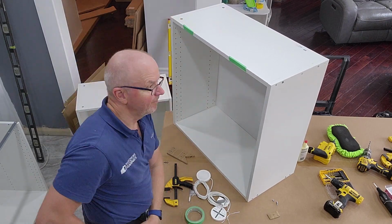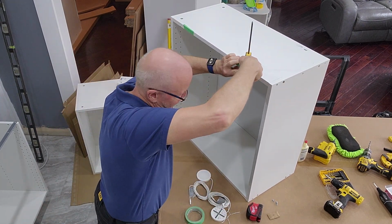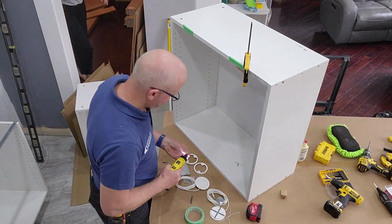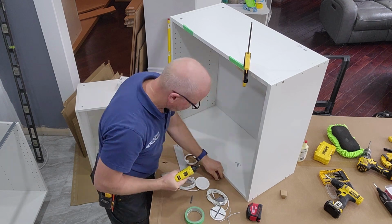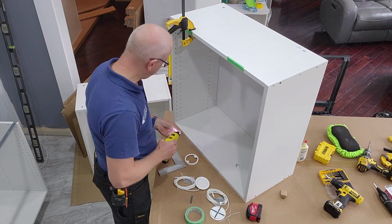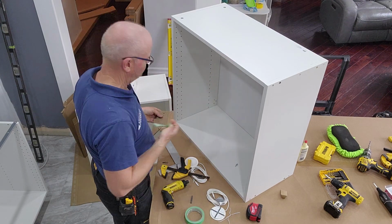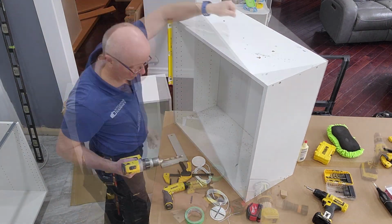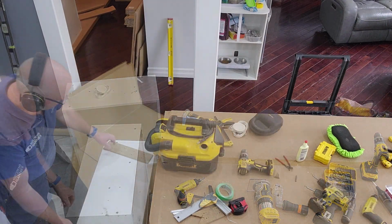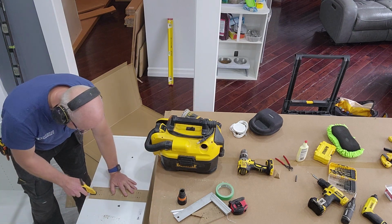I'm not going to explain how I put those spotlights inside the cabinet because I showed you that already. What I want to tell you is that we need to find a way to hide away those wires that come out on the top of the cabinet, because we don't want them on the inside and they cannot be sitting between the cabinet you're seeing here and the one that is being installed on top of it. Since they are stacked, they sit nicely together, those two cabinets. So putting that wire in between there is not an option. No way. So what we want to do is make a groove on top of that cabinet in which the wire can run.